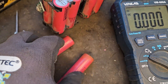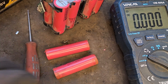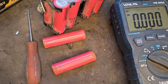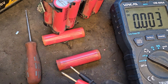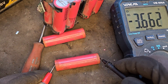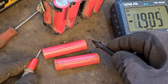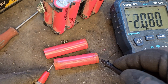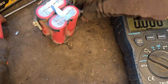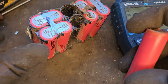What I intend to do is replace them with these ones. These are a slightly different brand — I think the ones I took out were Sanyo but these are LG. Same output — they're 2500 milliamp cells, just like the ones in the pack. One is at 3.85V and one is at 3.66V. They will balance each other out when joined together, so there won't be too much cell imbalance and we should get nearly full charge.